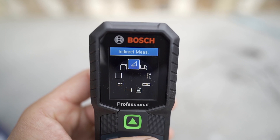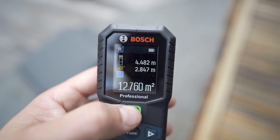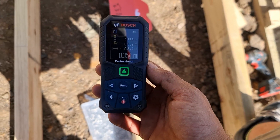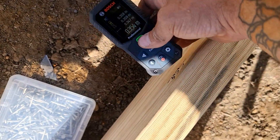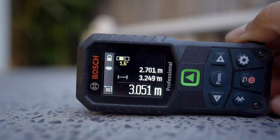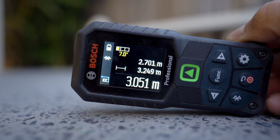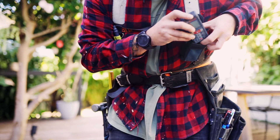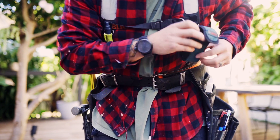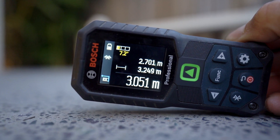The colored screen on this thing is really nice. All the numbers are white and they appear on a black background, so it's really easy to see even in really bright daylight. It's also got your incline level on here as well, which basically looks like a little level with a bubble that moves back and forth. I actually use that incline level all the time — I just have one of these clipped onto my nail bag and if I'm ever on a roof trying to calculate the pitch, I drop it on the roof and it will tell me whether it's five degrees, 15 degrees — super handy.